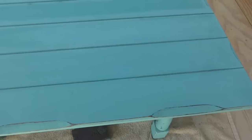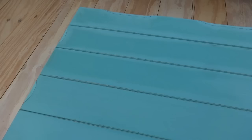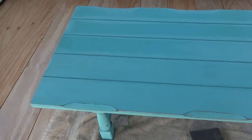Of course they're coated in dust — I'll have to clean them up before I clear coat. The reason I want to clear coat is because this chalk paint is really, really flat, and if you know anything about flat paint, it will mark really easily. So if someone sat a cup on here or scratched something against it, it's going to leave a mark. You don't want that, so we need to protect it with something. But I want that really flat chalky look, so I don't want to protect it with just anything.